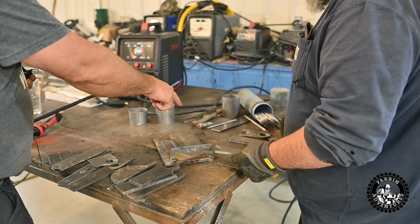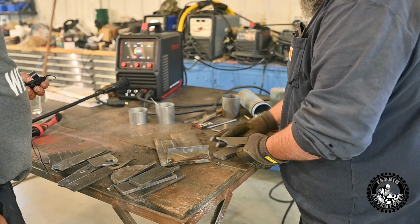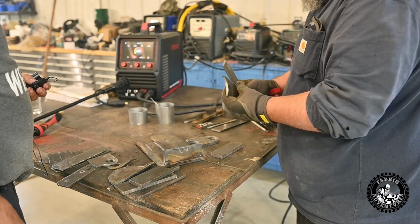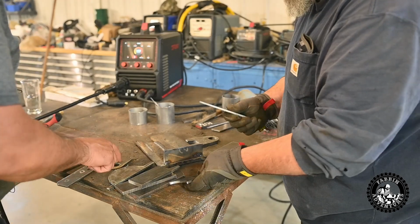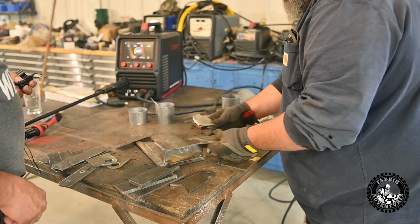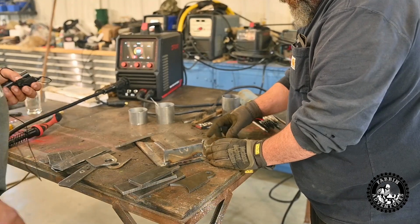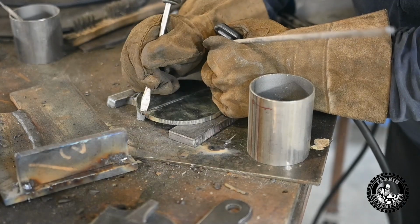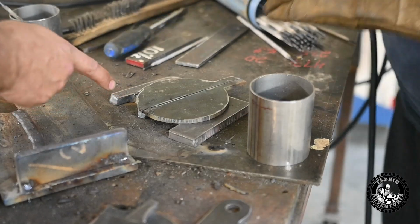You want to do it right on the plate, or do you need it to hang off? No, this is fine. I can just do it right here. I'll set this here and this here. Grab a couple pieces. One's 3/16, I think. So 1/4 is this stuff here. Pieces of 1/4. Yeah. Normally, a guy would grind that little bit of slag out of there, because that would cause porosity, right?